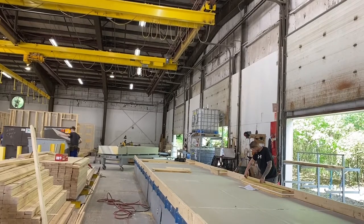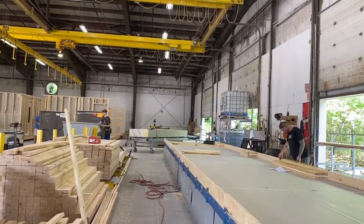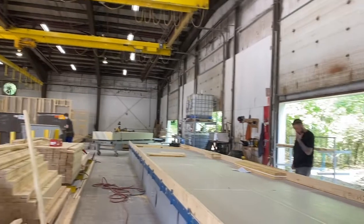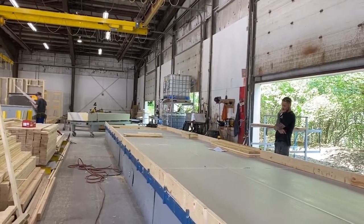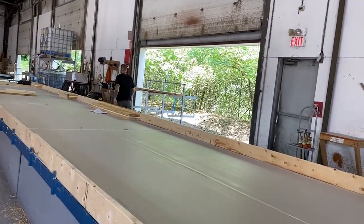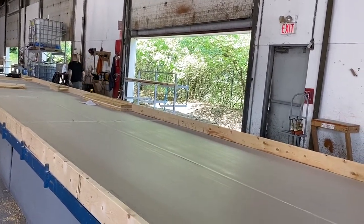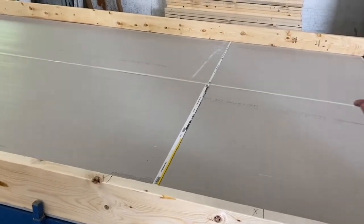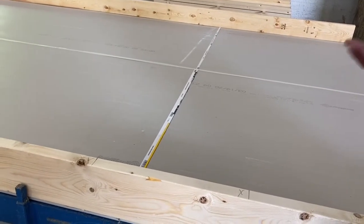And then the only time you'll see screws on our exterior walls is when they cut out that door over there, or cut out the windows. They'll put screws around the perimeter of that, which gets covered up by casing. So you don't have any nail pops to worry about in our exterior walls. And this bond, number one, you bond the entire length of that stud. Number two, we shoot the plates where it seals off the wall cavity. So it helps tremendously with air infiltration.